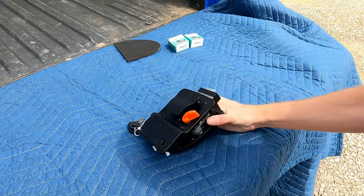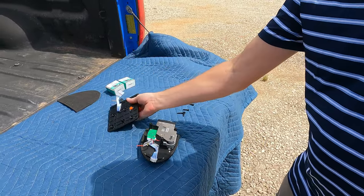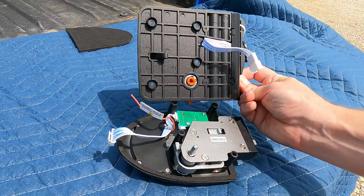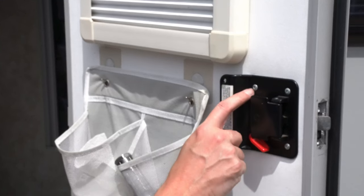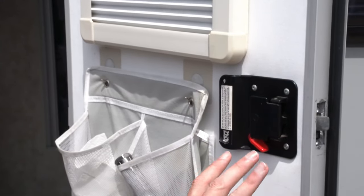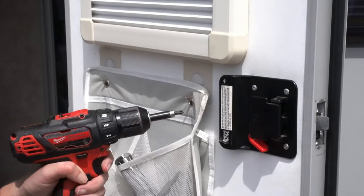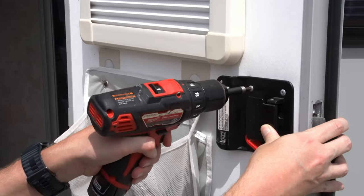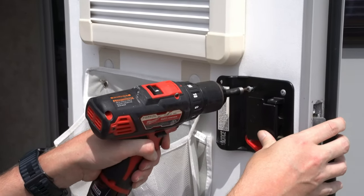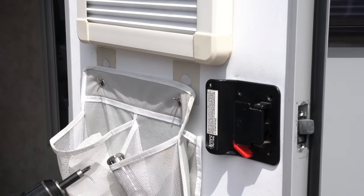The lock gets shipped in two parts, the inside and the outside, so we need to separate the two pieces so we can begin the installation. It's also good to see how the two pieces fit together. Next, we're going to take this plate off and check the sizing of the hole. You'll notice these are not your standard screws, but a Phillips screwdriver bit should be just fine — just take it slow. That came off a little easier than I thought.